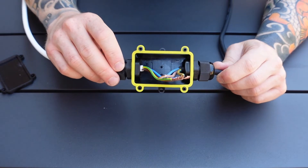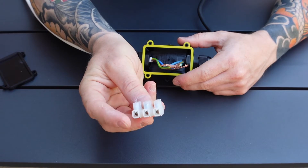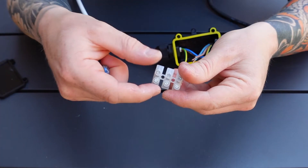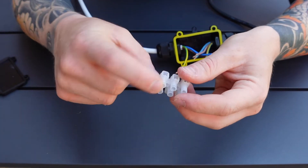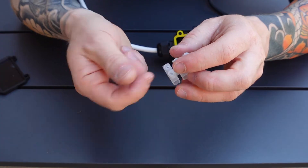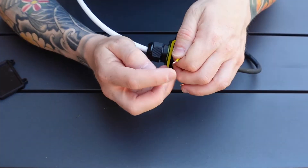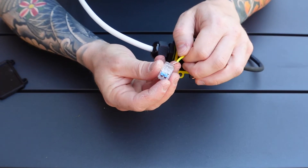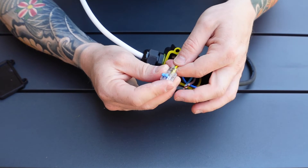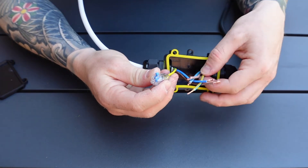Now I'll quickly show you just how to put those cables together. You could use one of these little connector blocks, however I'll show you this using some push-fit connectors — they're much easier to use than the traditional connector block. I'll put a link in the description where you can pick some of these up. All you need to do is flick the little levers up, wind your conductors together so that all the strands of copper are together, push them all the way in, and then flick down the little lever that locks the cable in place.